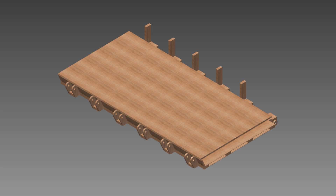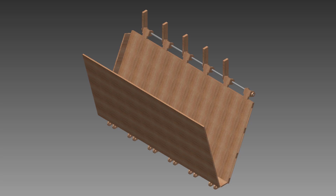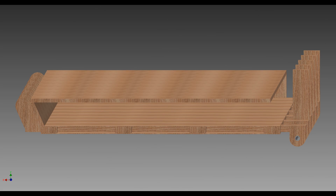Today we're going to start work on my plywood and sheet goods storage solution. I don't have a large shop, so what I came up with is a storage rack that essentially hangs from the ceiling and then folds down to allow you to access the sheet goods. This picture here shows the sheet goods storage rack in the down position. When it's opened, you can flip through the sheet goods, get what you want, pull it out and it will be at waist level, just above my workbench height. Then it folds closed and rotates around the pivot and it sits up against the ceiling. That way it essentially just saves a bunch of space in my shop and allows me to utilize that space more effectively.